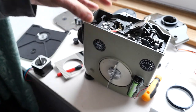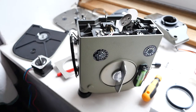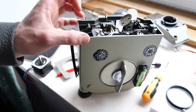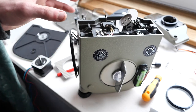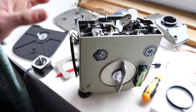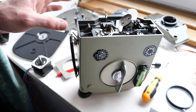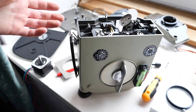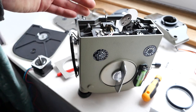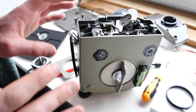I'm not going to play about with it. The only issue I've noticed with this camera is that its framing is not exactly accurate — I framed up just an image of a square on a computer screen so it looked perfectly framed in the viewfinder, but on the actual film itself it was off to one side. I'm not sure I can fix that; it's maybe about a fifth or a tenth off to one side from what you see in the viewfinder.